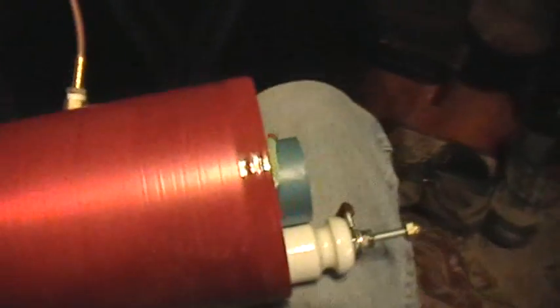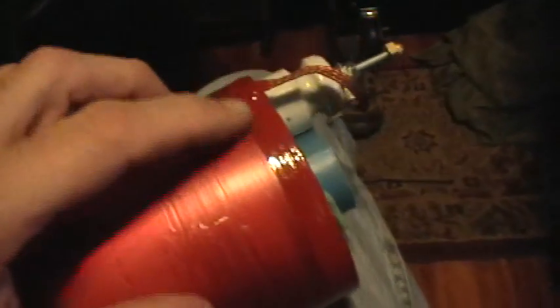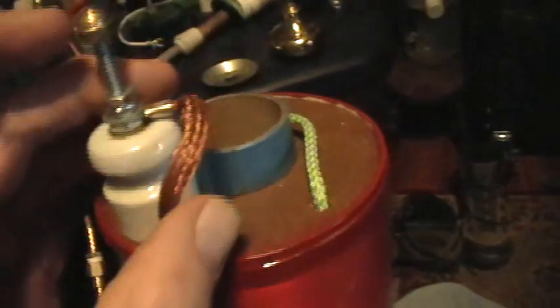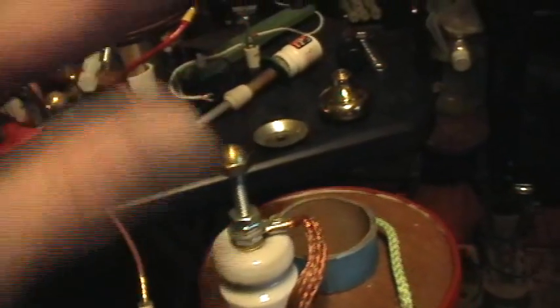The secondary itself is a piece of white PVC pipe, four and a quarter inches in diameter, wound with 750 turns of number 27 enameled magnet wire, then sprayed with about two cans of Krylon. The ends are coated with some red corona dope, and then it's terminated with this braid into a little stick-up terminal that makes a pressure contact with the top capacity.